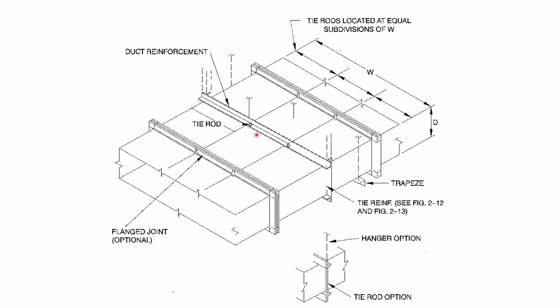Even for very big ducts, we can use a technique called duct reinforcement. We put two angle irons sandwiched at the center of the duct and use a tie rod to screw them together. The angle iron must be riveted to the duct so it acts as reinforcement. This is one of the methods SMACNA suggests, and it allows us to reduce the duct thickness and avoid a stronger duct joint while still achieving the same duct integrity.